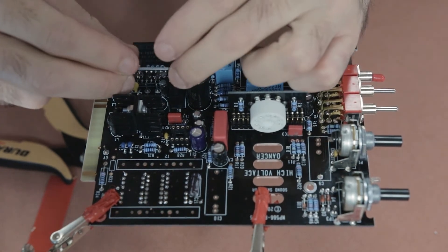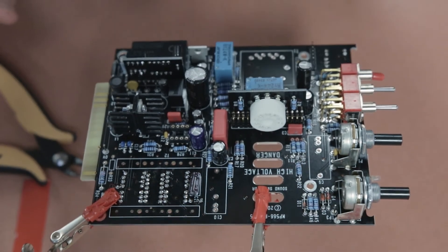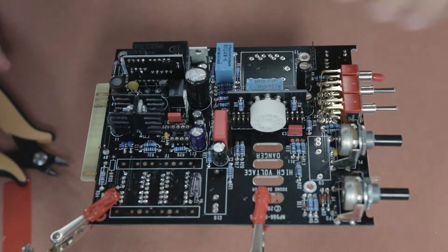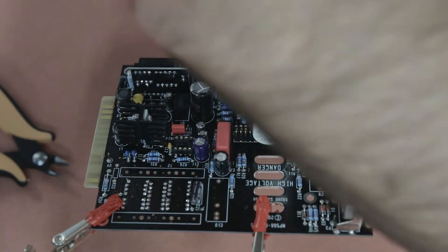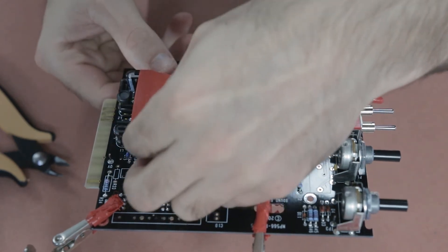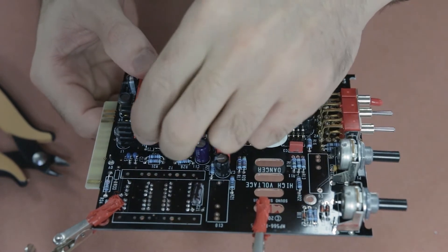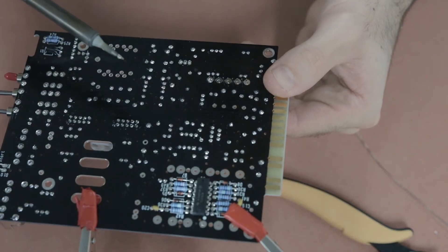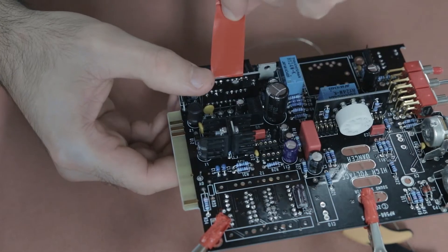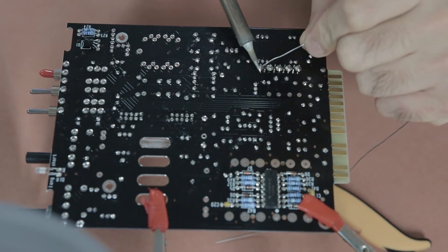Once the power-up PCB is finished, it's time to insert it into the main PCB board. Make sure the components on the smaller PCB are facing the voltage generator at the bottom of the main PCB — you can see I've got that orientation correct. You'll need to hold it in place so you can solder it nice and perpendicular to the main PCB, so I use some tape here again. As always, solder one leg first, check it's sitting in nice and neat, then solder the rest of the pins.